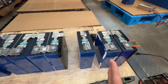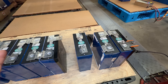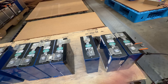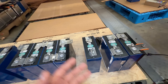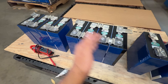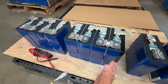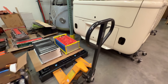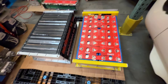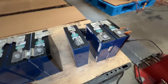Usually I think it's a bad idea to remove individual cells — why would you do that if you're just putting them back in a series string? Figure out your strings and leave them. Most people will want to use one of the standard voltages: four cells makes 12 volts, eight cells makes 24 volts. For 48 volts, you do two strings of eight cells — eight cells this way, then it jumps over and it's another eight cells.